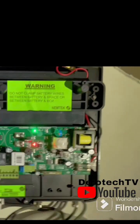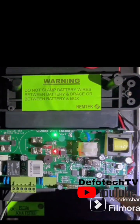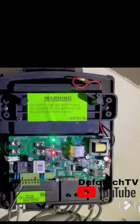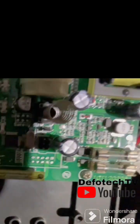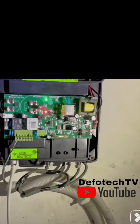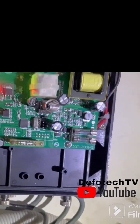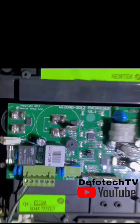There are two more fuses — one is for battery protection and the other is for the auxiliary. If the battery protection fuse is blown, the battery system won't work — connecting the battery will not turn the energizer on. The fuse on top controls battery power, so without it the energizer cannot turn on at all. The fuse on the bottom controls the auxiliary outputs — if your siren or strobe terminals are not working, check that bottom fuse. These jumpers are also used to program the energizer.